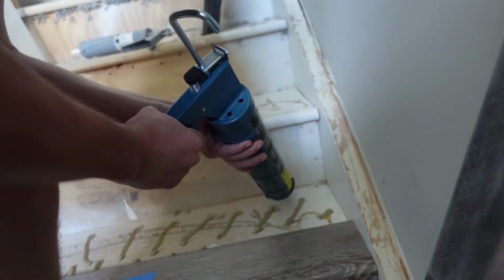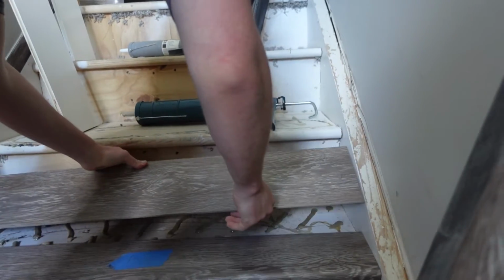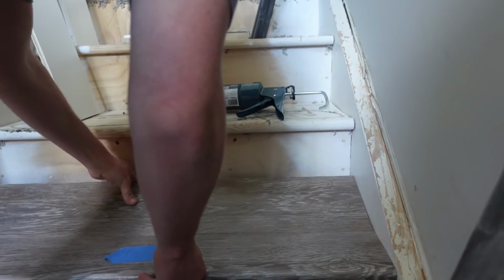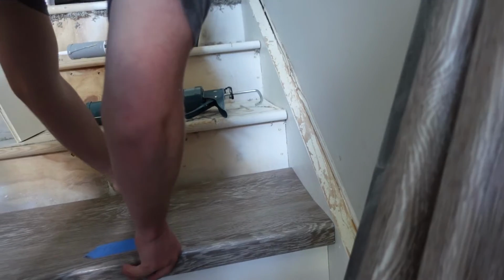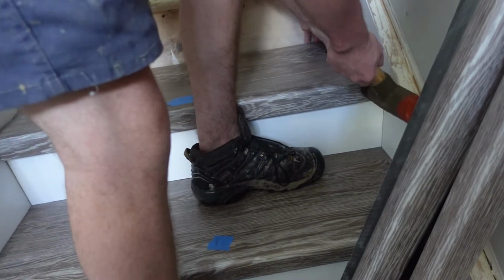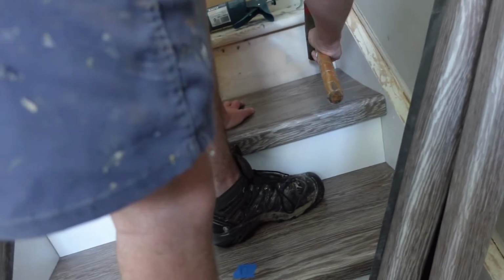These boards, of course, have all the padding removed from the back, scraped, sanded like we showed. Now you see, once we put it in, there's your mallet. Once we lock it together, then we don't have to worry about it squeezing through the locking system, and only then can we push it down into the glue.